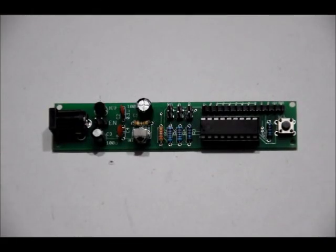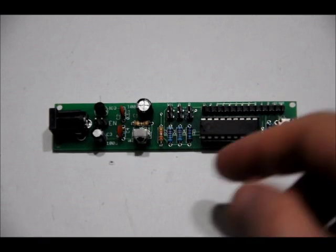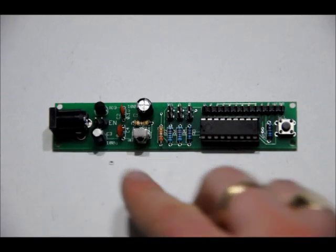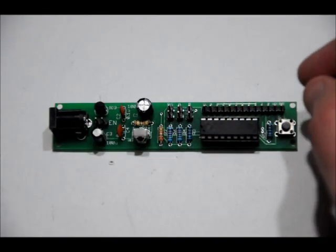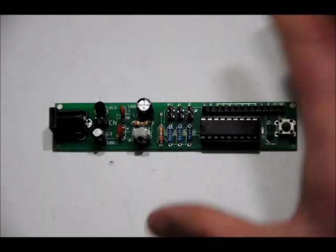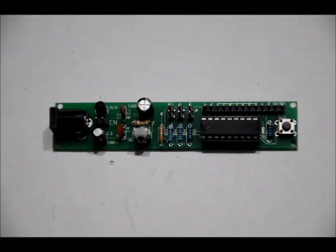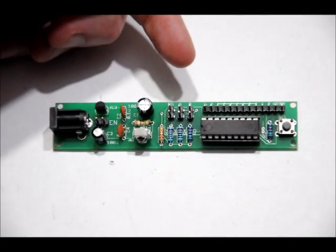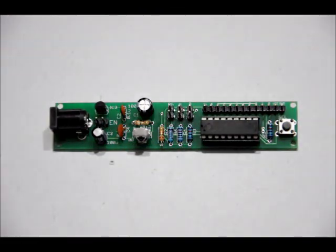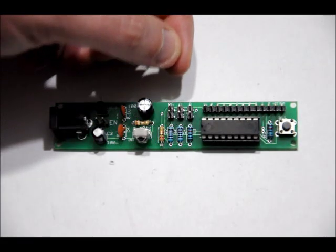This is the Version 2 unit — pardon the lighting. You can power this directly from your Arduino if you'd like. There is a power-enable jumper here. When disconnected, you can use the power rail to connect to the regulated 5-volt port and the ground port on your Arduino, and it'll automatically be powered. Obviously there are no relays and no LEDs, so we don't need the LED Enable pin or the relay jumpers R1 and R2. We've got PG for program, A, and B.